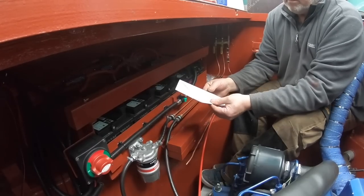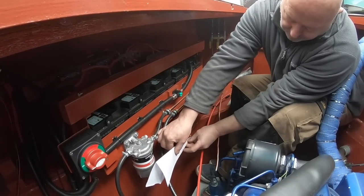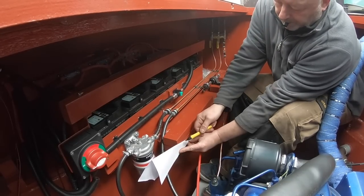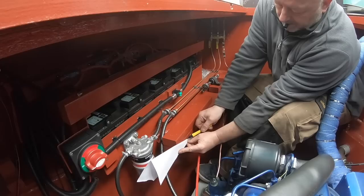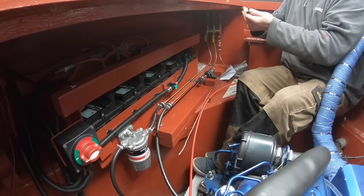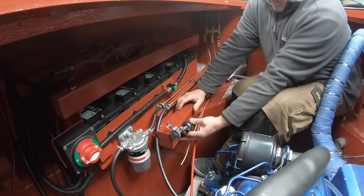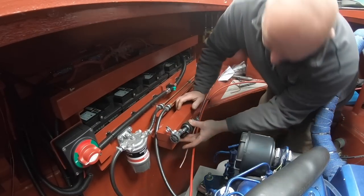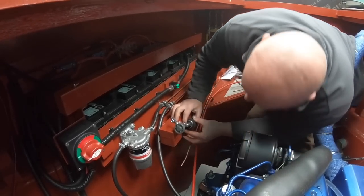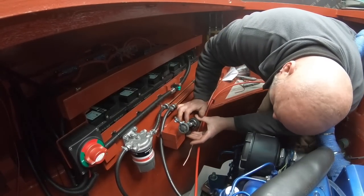I might need to go shorter actually, won't I? No, not a bit thick today. If I put that there like that, that gives us the right angle for it to be fitted at. And if I just put a little mark on there, I know that's the angle we're going to fit the pump at. So if we just get on there like so, and then. If we had the angle any bigger, it means that the fuel line starts to dip down, don't it? Yeah. It's harder for us to fit in, so that's why we've gone with 22.